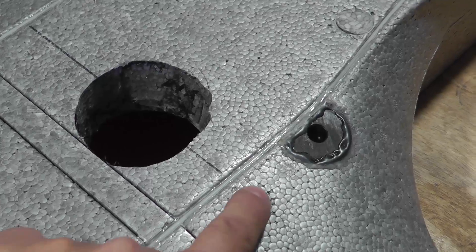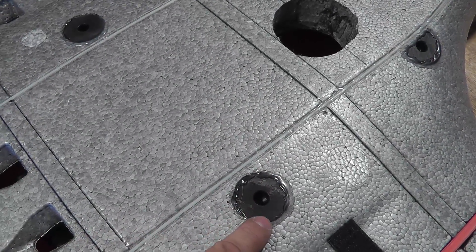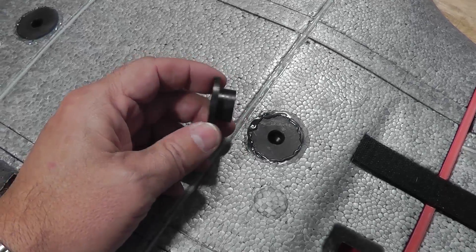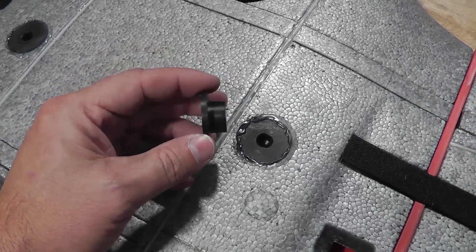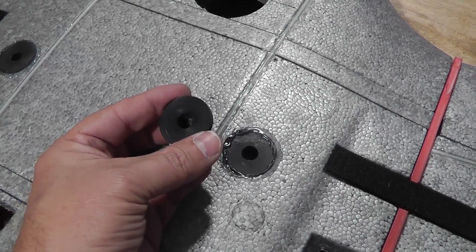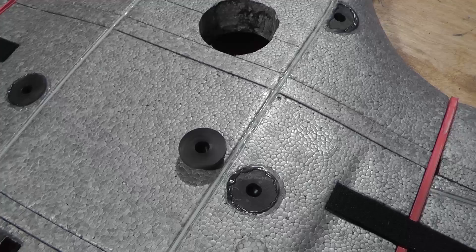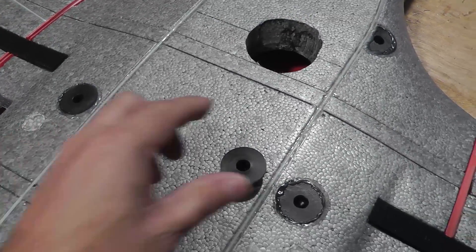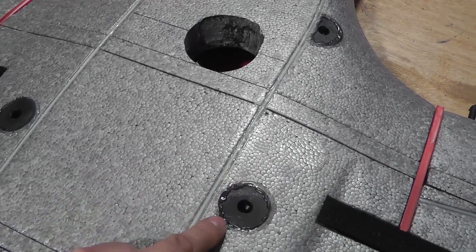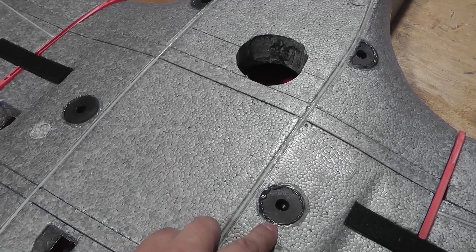These lugs accommodate my catapult launcher pins. It's really simple — I just turn these from a Delrin rod on a lathe. The hole is 3/8 of an inch and the width is 1¼ inches. It's quite simple to do and has proven to work pretty well. I was a bit concerned with just using hot glue and no other reinforcement that you might develop cracks in the foam, but after several launches now it hasn't caused any problems.